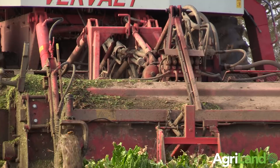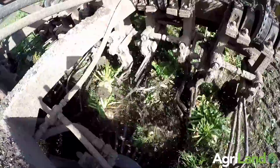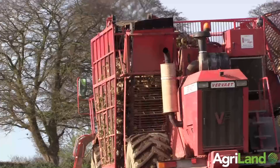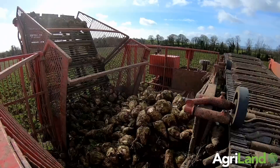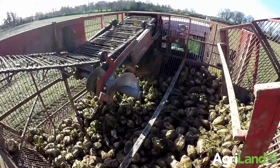She's got a topper out the front, then scalping knives next, then vibrating shares after that which throw the beet onto the carousel. The carousel goes back underneath into the middle of the machine, back around to the back, back up onto the ring truss, and overhead into the tank. The big auger in the tank augers across to make sure you get a good full tank when you're unloading.